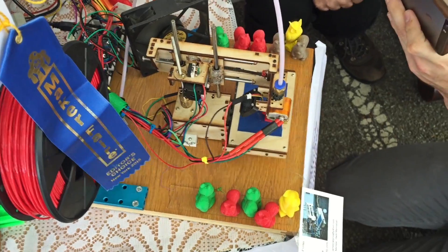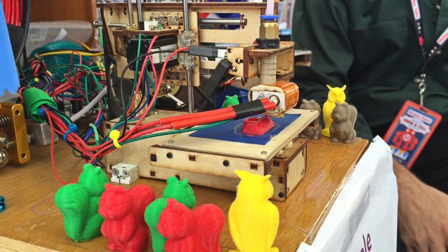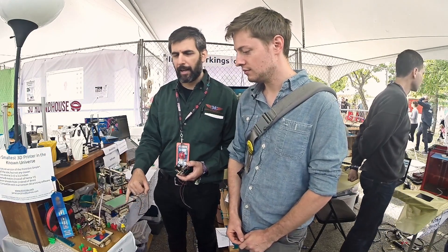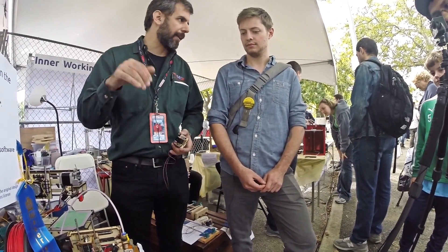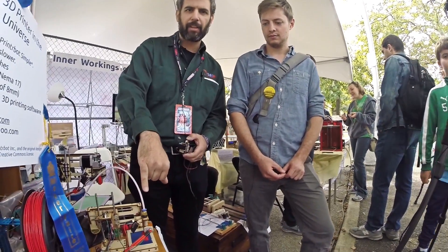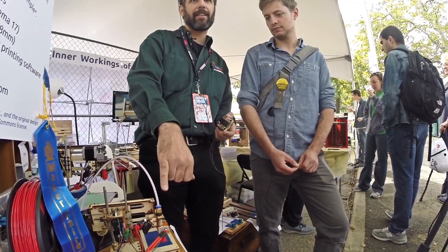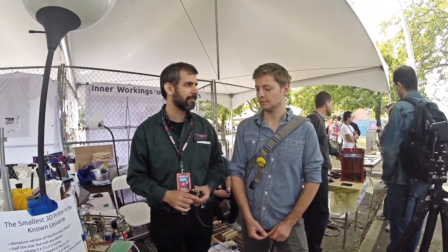So the nozzle — you custom made this on a lathe? Yeah, that's a PEEK nozzle. The conventional J-head kind of nozzle with the heat insulator, but using a Mark 7 print head and heat block. And I might not stay with that, but it actually works very well. It seems to have plenty of flow, it works just fine, it doesn't overheat. I'm going to have better mounting — this was the first model, I just kind of clamped it on there. I wanted it to be to scale, so that's like a 3 and 1/8 inch piece, and inside is a 3mm Teflon tube.